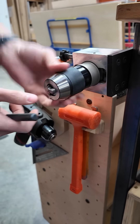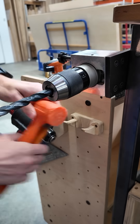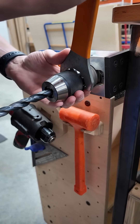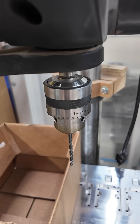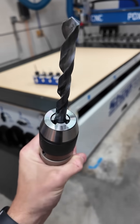It's pretty simple to just spin it out. There is a special wrench for this — they're pretty affordable and we will have them — but you can also just use an ER32 collet wrench, it just does a little bit of marring. It's just like using it on a drill press, except on our CNC router it's a little better, definitely better runout.